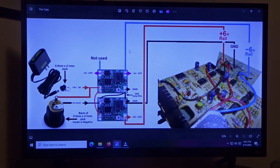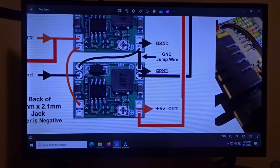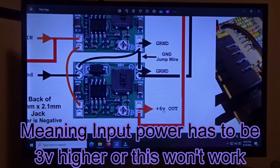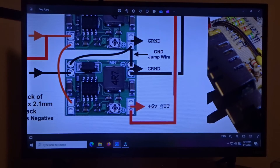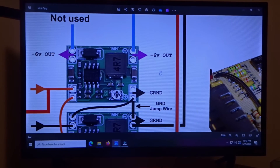There's one important thing I forgot to mention: before you make your positive, negative, and ground connections to your Rockman, make sure you have power coming into your board and set the trim pot on the positive side. Cyber Cow told me 6.5 to 7.2 volts is a good range — he said these things are a little finicky but once they're set, they're set. Say we're setting it at 6.5 — he also said that on your negative rail, you want it to be 0.2 volts less, so 6.3. I did see on eBay someone else had the voltage set at 6.4 on the positive and 6.0 on the negative.